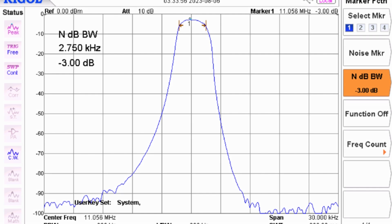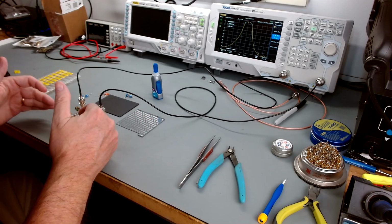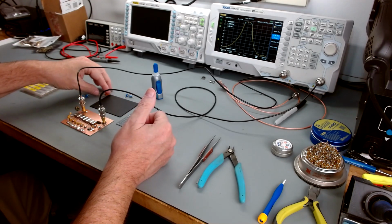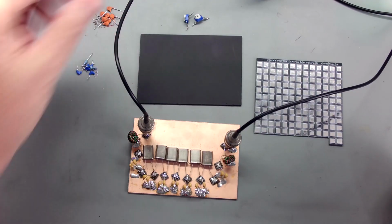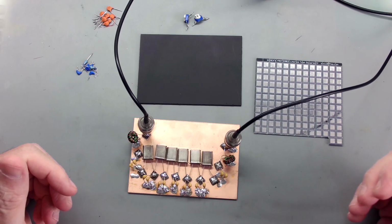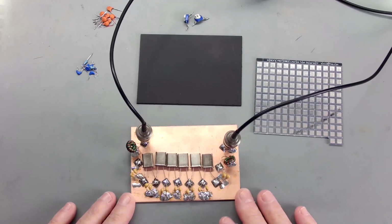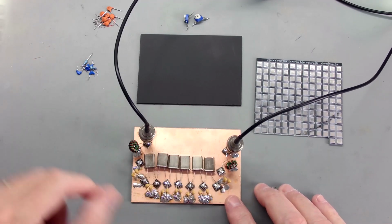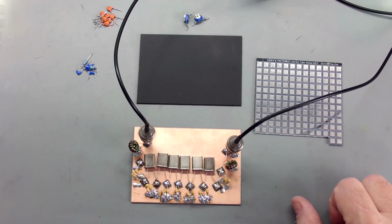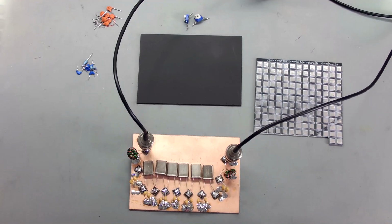And then the problem was, of course, in matching impedance. Before I created these transformers, my losses were pretty good. They were around 6 dB. They weren't horrible. But I felt like it should be better, looking at other crystal filters. And so, you know, we want to get it right. But I had hoped that matching the impedance would help there.